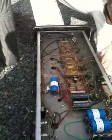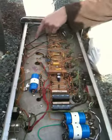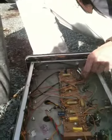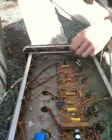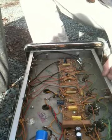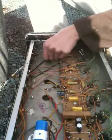I sprayed the inside of the pots. I did all the stupid stuff, you know. I changed this wire. There's wires that I would like. This shouldn't be that long, and I would shield it. There's a bunch of wires that I would shield: anything that goes to a grid, and anything that comes off of a volume pot. That's good. I should look at that.